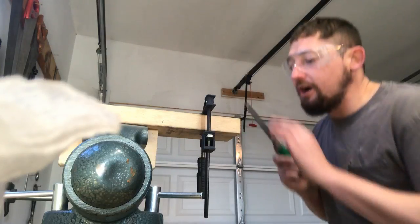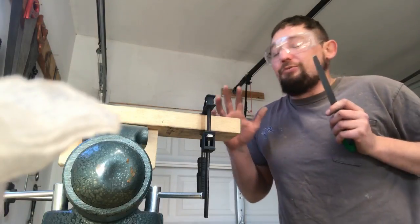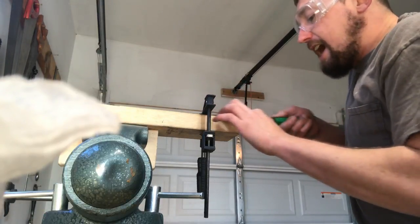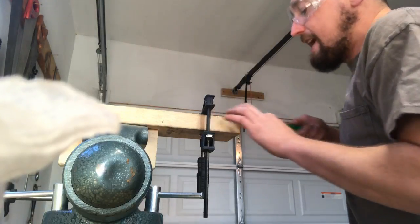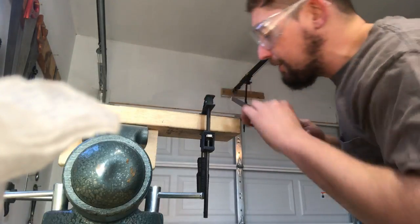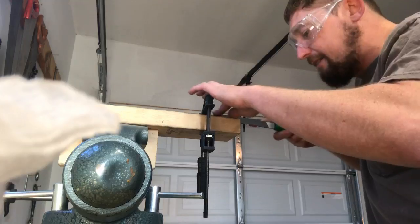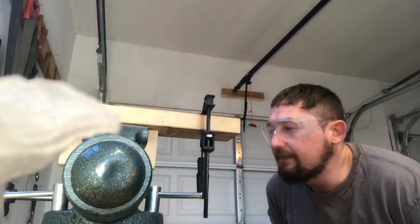Take a little bit off, look, because so many times I've gone too far, and then your reed's askew on this plane, askew on this plane, because you just took too much off. You've got so much work into this harp, into bending it, getting everything ready. We don't want to fail. This is the area where I have failed and will fail in the future the most often. Make sure we're not taking too much off the front, off the back, all of that. Everything in harp building affects everything. So it's really important in this respect that we get things correct.